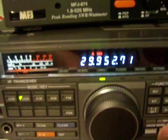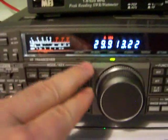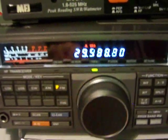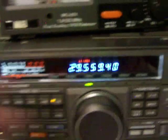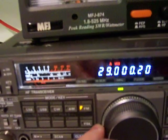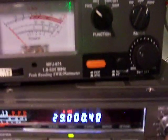Let's go to 10 meters now. Let's go to 29.00. Let's go to FM — 29.6, the calling frequency. 100 watts out. Let's go to 29.0, which is the AM calling frequency. We've got 100 watts, but it's picking up my modulation. Let me turn the audio down — dead carrier is 100 watts. Let's also test sideband on 10 meters. Got to turn the audio up again.